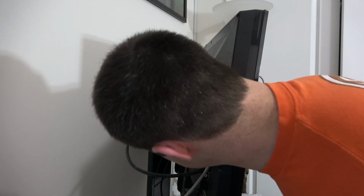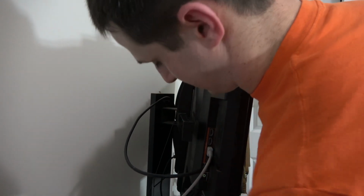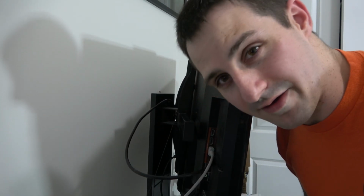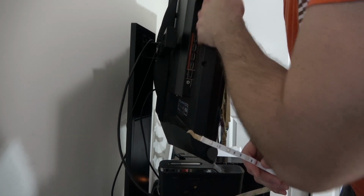It is dusty and dirty, and you don't want to stick anything to a dusty, greasy, or dirty surface because it's not going to stick for very long. Especially something like these LEDs. While they are LEDs, so they're efficient, they still will get quite hot, and you do not want glue to get warm when it's not that sticky, because then it'll become unstuck and you'll have crappy LEDs making everything look worse. So right here is the starting point, and we're just gonna do our best to not screw it up.